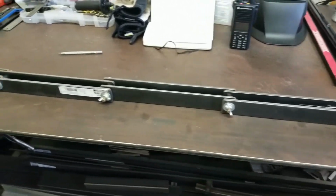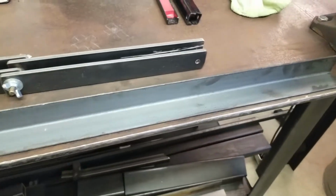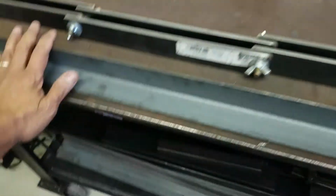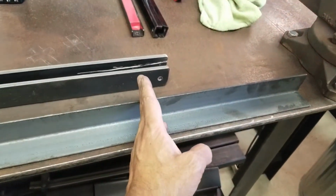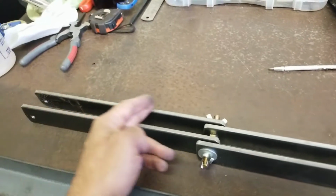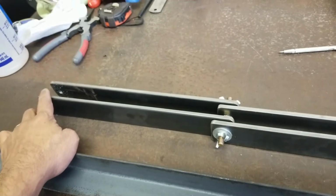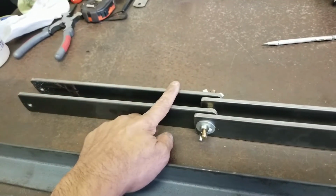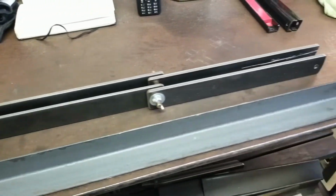So here's just a quick view of the frame. So this angled steel would be the cross members for this. So I'm going to work on that and get back. So I'll have to cut these into 1 foot sections and figure out how many I need per section here. I'll probably need 3, given that these are 12 inches. We can place 1 at every 3 inches approximately. We'll figure something out, and I'll come back in a few here.